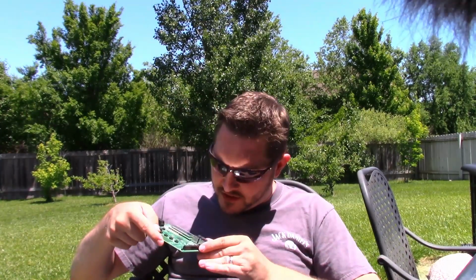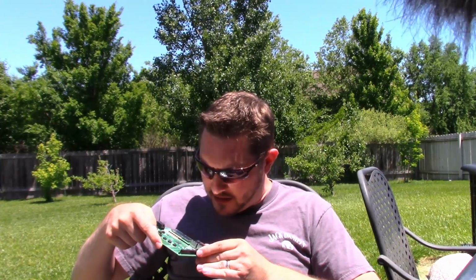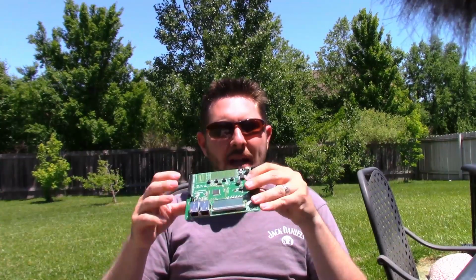They also include, I don't know if I can see the number on it, it's hard to see, the ENC, basically the standalone module. The reason this has two is because they allow you to have a PIC micro that has that module embedded into the PIC, where you can configure one port that way, or you can configure this just like a regular standalone microcontroller, and then they give you the chip off to the side, because maybe you don't need the 32-bit micro, maybe you want to use just a regular 16-bit micro, but yet you want to add some Ethernet capability to it. Then you just add this ENC chip, and that chip will provide the internet for you, and it's just serially controlled. In fact, I think SPI is the interface to it. So that's a very good representation of a development board that you'll get from a manufacturer.